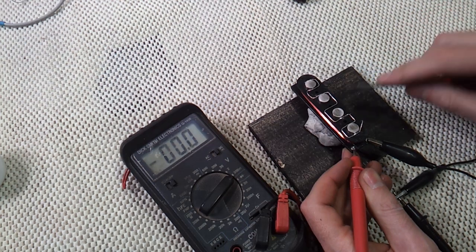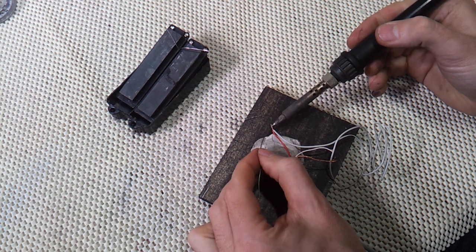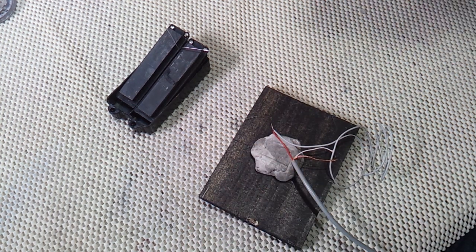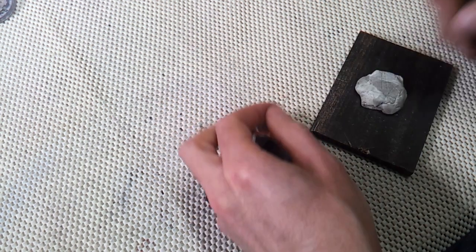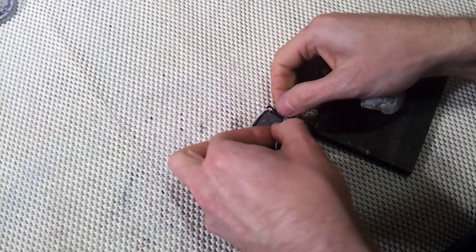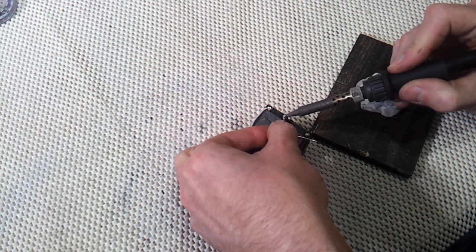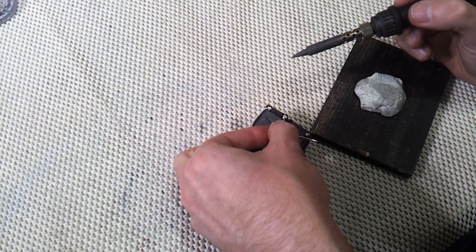For a Stingray pickup, the coils are wired in parallel, so here I'm preparing the lead by adding a little jumper wire to each core. I'm pre-tinning and trimming all four coil connections because, again, I have to be very quick with the iron for these eyelets. I'm getting the little puddle of solder in the eyelets just hot enough to push the wire into, then I'm out of there.